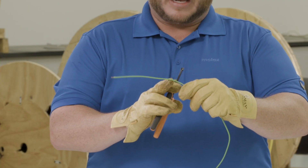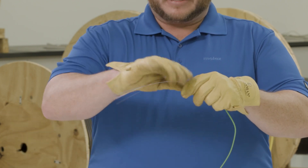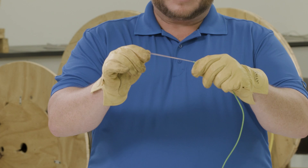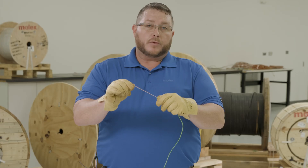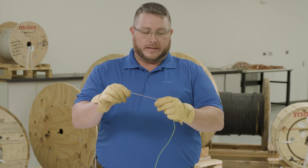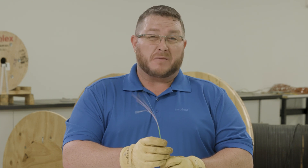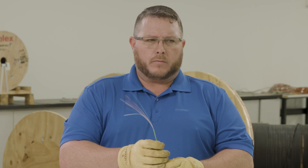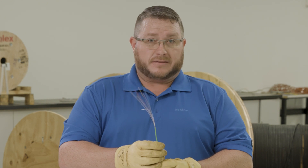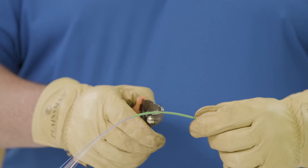I bent it and collapsed it right there. Let's open it up past that point and see what happened to the fibers. As you can see, even after that extreme bending and collapse of the buffer tube, it didn't hurt the fibers. The reason is that the actual inside of the tube doesn't collapse — it's the outside that collapses and allows these fibers to survive. Now let's talk about what happens to the buffer tube when you crush it. Technicians aren't perfect; they may shut it in a tray or close it in a door, and the buffer tube will get crushed.